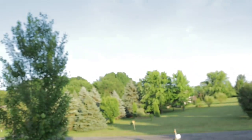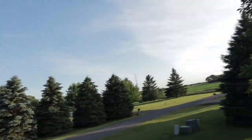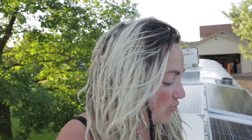Blue got the panels attached to the roof and no rain — that's amazing. Look at that, blue skies as far as you can see. We were lucky enough to not have rain. We have the panels hooked up together in pairs of two, so they're run in series, and then we have all of them run in parallel, just like you would do with the battery bank setup.